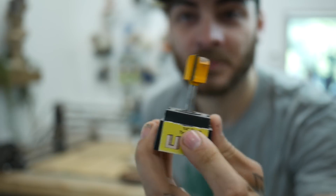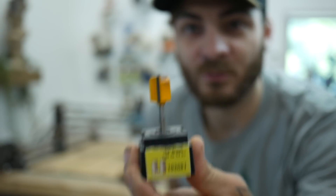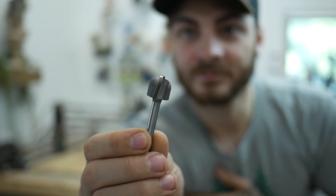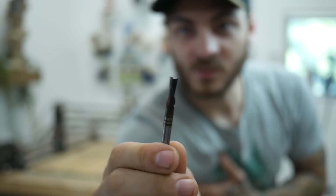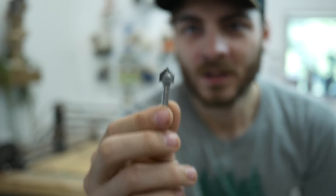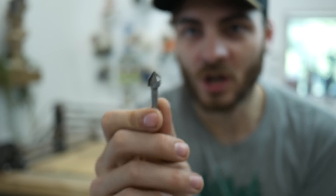For the first bit, I used a three-quarter inch straight bit — just a regular router bit, nothing fancy. I use this as my roughing bit and it removes the bulk of the material quite fast. Then I use a dish bit — you can cut the whole thing out with a dish bit, but it leaves a slightly rougher bottom, and this adds a nice little cove on the inside. To cut out the trays, I use a quarter inch down cut; up cut works just as well. For fine details, I use a 90 degree V bit — 30, 60, 45, and 90 degree are pretty much all I use.